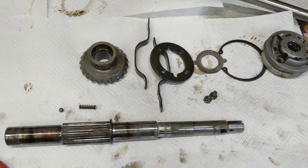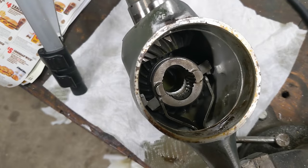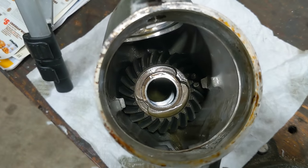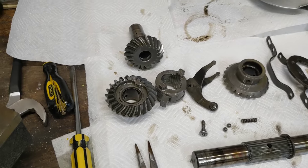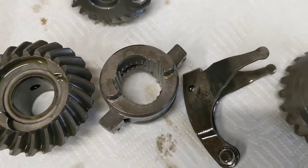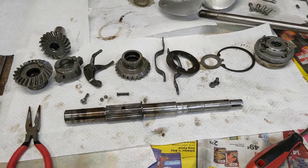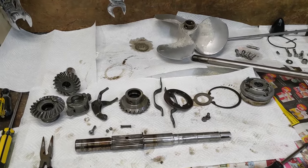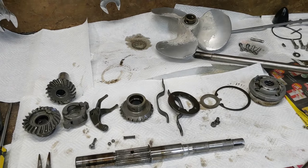So far I have these things out, and the things remaining in there look like this. I'm doing these videos as much for me to try and remember how this all goes back together. And there's that forward gear — those little roller bearings are my fault, I dropped them down in the top earlier. Unfortunately, everything looks perfectly fine. There's no dings, no stripped stuff, nothing's broken, no missing teeth. Everything looks great in here, and that's a problem because it means I've taken this lower unit apart for nothing, and I'm not going to remember how all this goes back in, and I haven't found the source of that clunking shift-jumping thing.